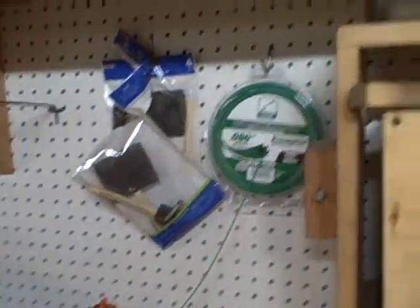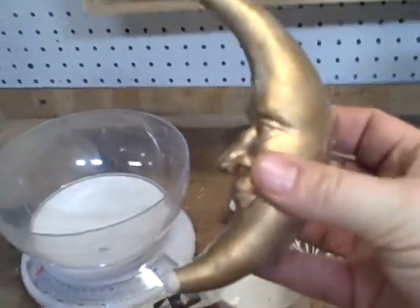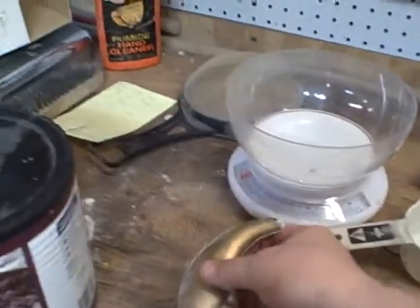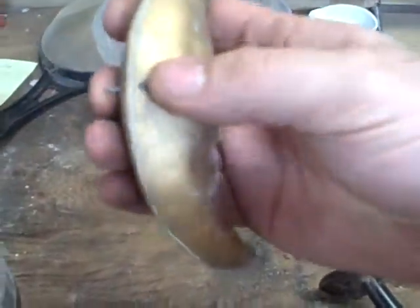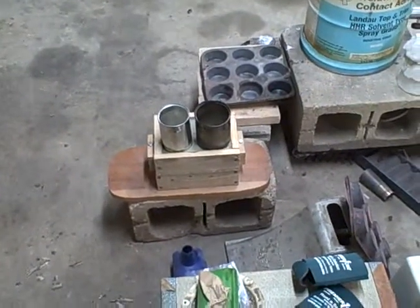The pattern I'm going to cast — or attempting to cast — I was just looking around for random things in the house. I think this is some weird ornament my mom had, a moon. I've cast this before when I was trying out green sand, but I could never get the water content right, so I went to lost foam and got kind of good at it. It's a split pattern, held together with nails. I rammed that up in a little flask I made about a year ago. This is my first attempt with the K-Bond, so we'll give it a whirl.